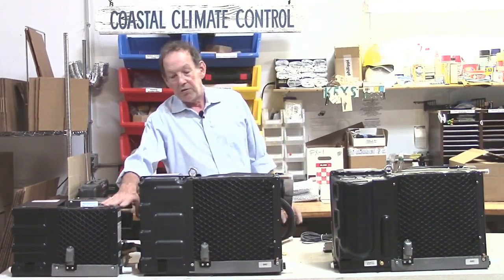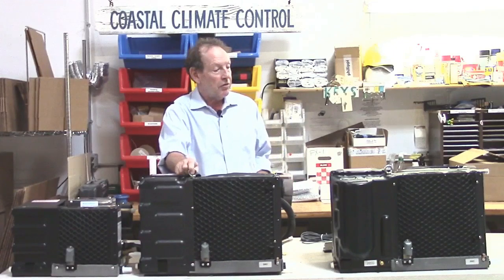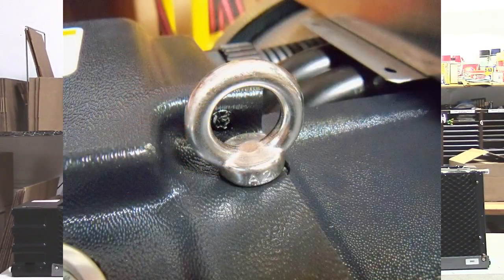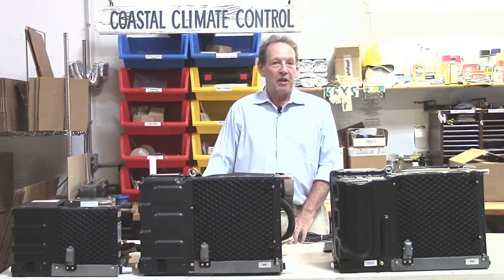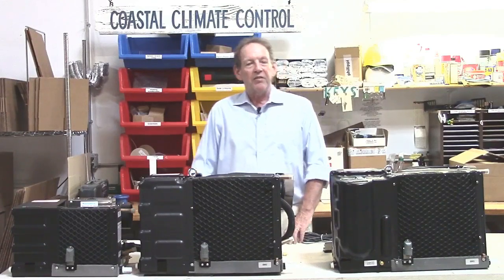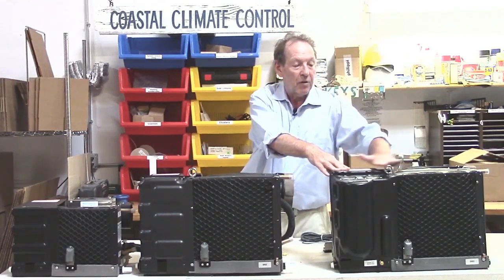The condensing coils here are copper nickel with 5/8 stubs coming out. On the top you'll notice here too a ring here, which is a very interesting feature, and if you ever installed these, I've installed many marine air conditioners over the years. Sometimes it's very difficult to get them up on the boat, especially the boats out of the water, and then back down inside and then into its location. So this lifting ring, which just comes off afterwards, you can just unscrew it if it interferes with the height aspect.